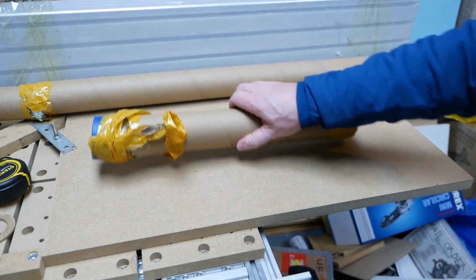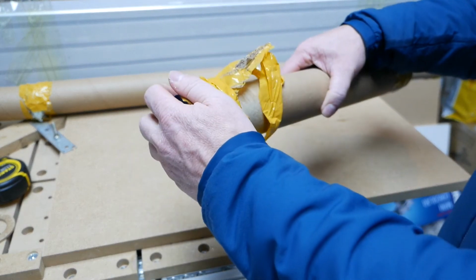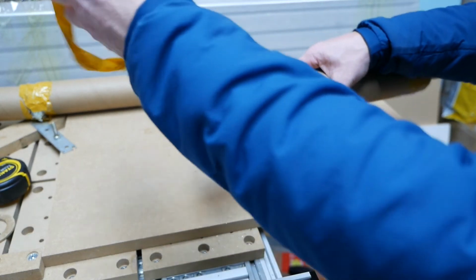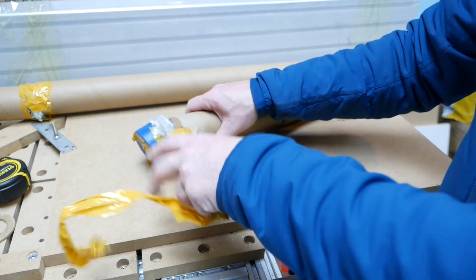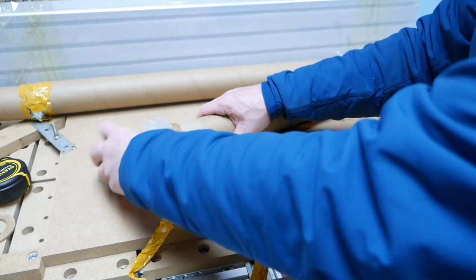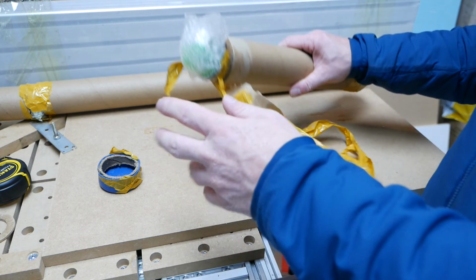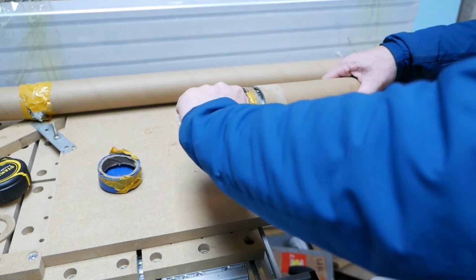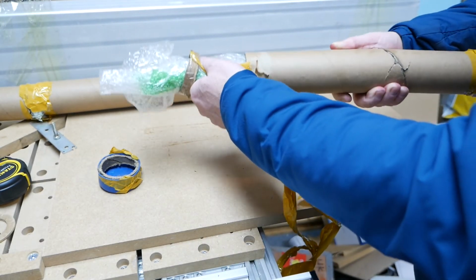Okay, next up we have tubes. Okay, so these are the ball nuts. So this is a bit of tech I've not got any previous experience with. The normal Queen Bee as we stand right now uses an Acme thread. The Queen Bee 2 is literally just releasing. That is using a smaller ball screw system than the Nighthawk. So if I get this out, it's quite a tight fit.